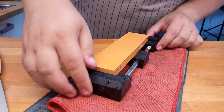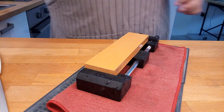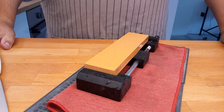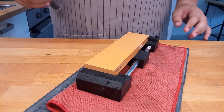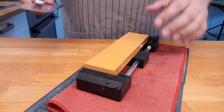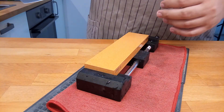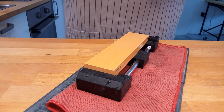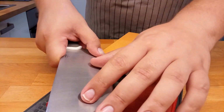So, as I said, this is the FEPA 1000, which is around 5 microns and is the equivalent of Japanese industry standard 3000. I will do two things. At first, a dozen passes on each side, a couple of times, for refining the scratch pattern on the primary bevel and then creating a micro bevel.